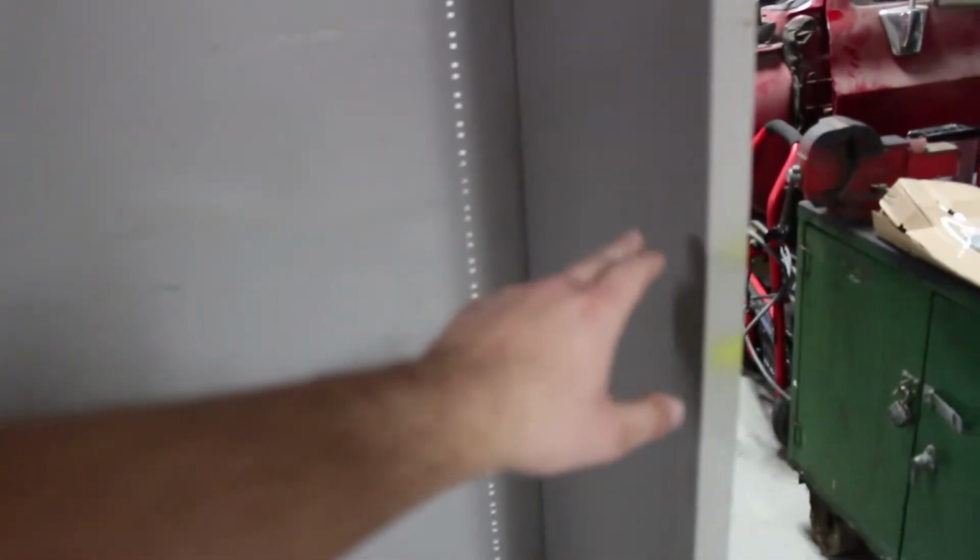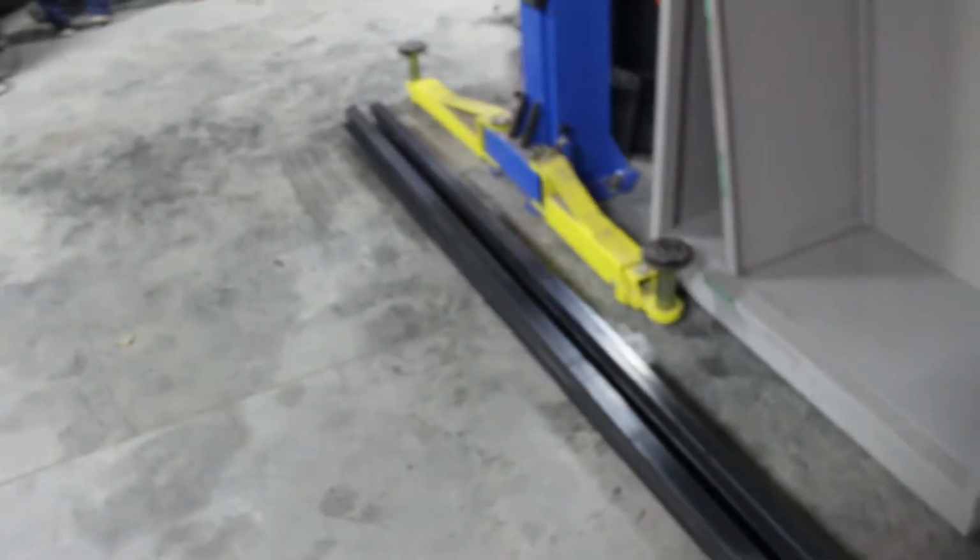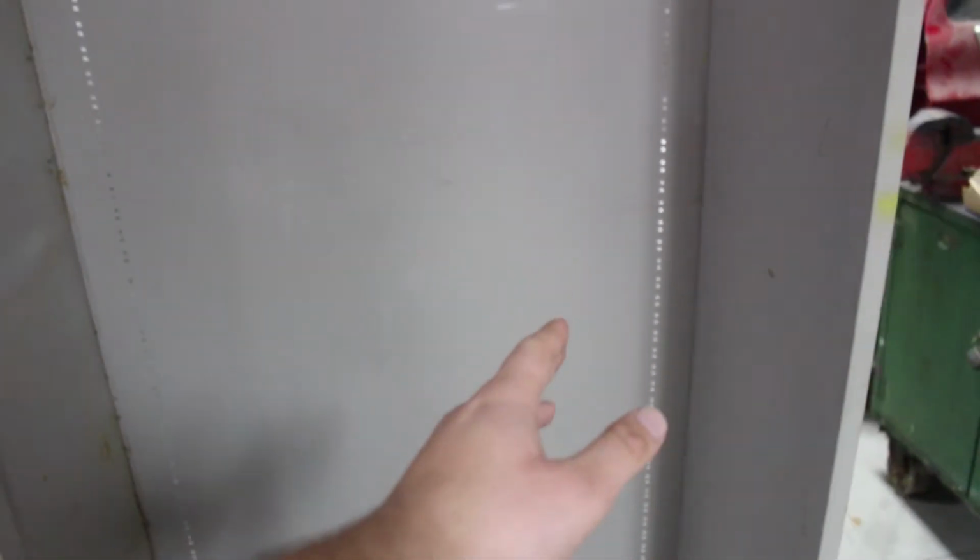One of them is going to be scrap to build a door and other items with it, like interior walls, and the other one we're going to build up to about 54 inches. I have 2x2 steel right here to do an internal frame, and in that frame I'm going to put 2-inch thick ceramic insulation. Then we're going to build a door for it and use the top part for storage, and it's going to be really nice afterwards. It's going to allow for so many more possibilities. That's the plan, and that's what I'm going to start working on. So let's get to it.